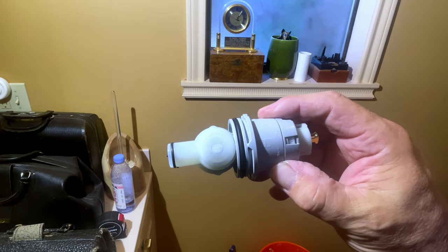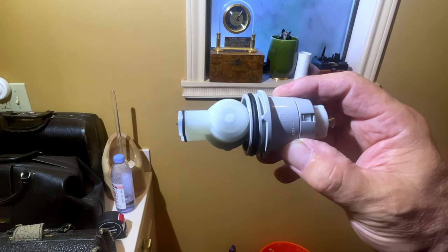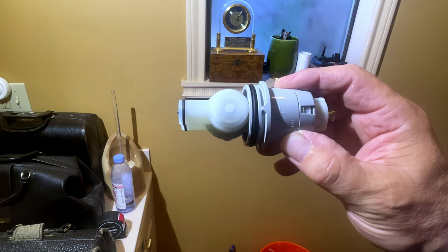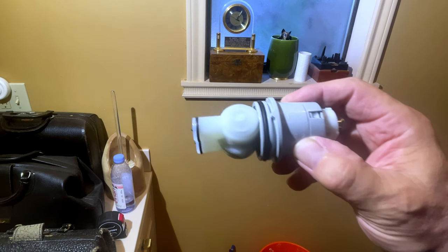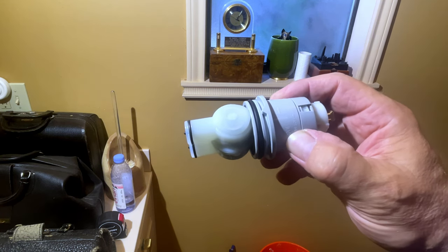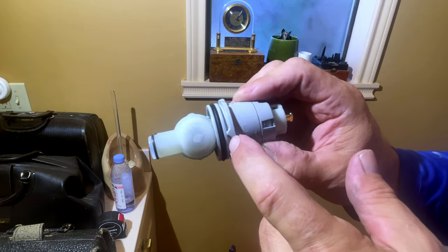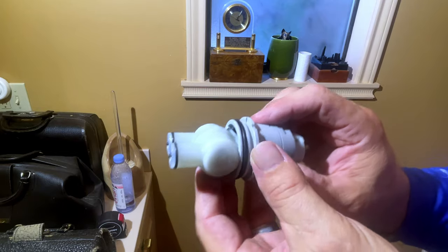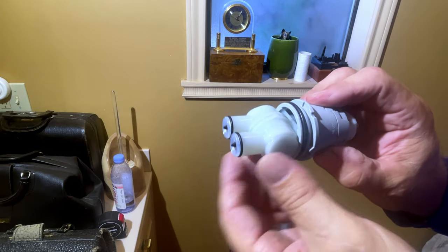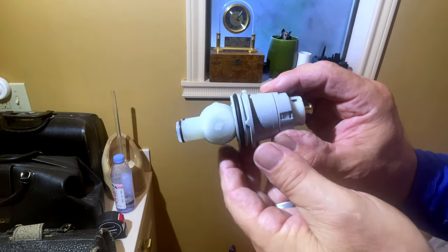And if you don't know how to figure that out, or you messed up, get your plug, leave your plug in to open up your shower valve, and just let the water run for a few minutes. You'll be able to feel your pipe so that you can tell which is the hot and which is the cold. But these little notches have to slide in, and it'll feel a little bit tight. You can wet the O-ring a little bit, and you've got two of them here too, but this is the main one that'll hold it. But you have to slide it in with the H.